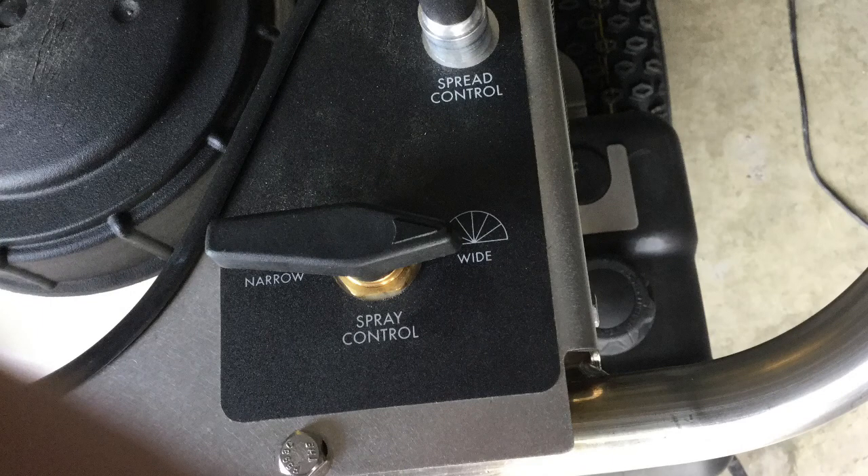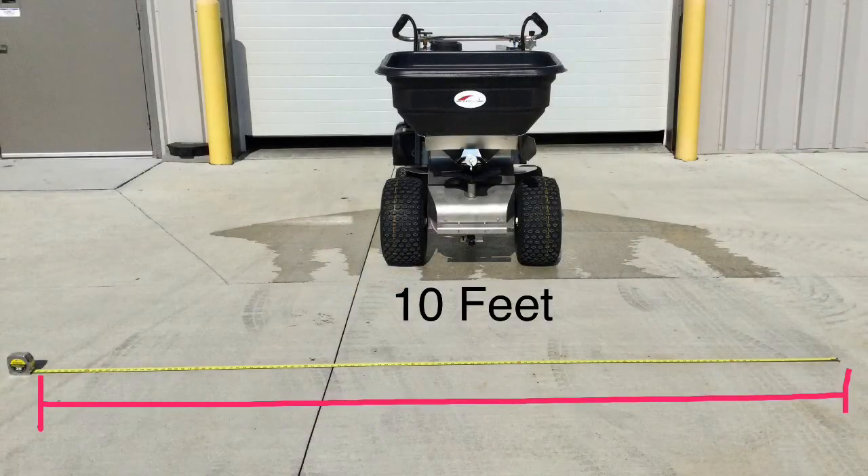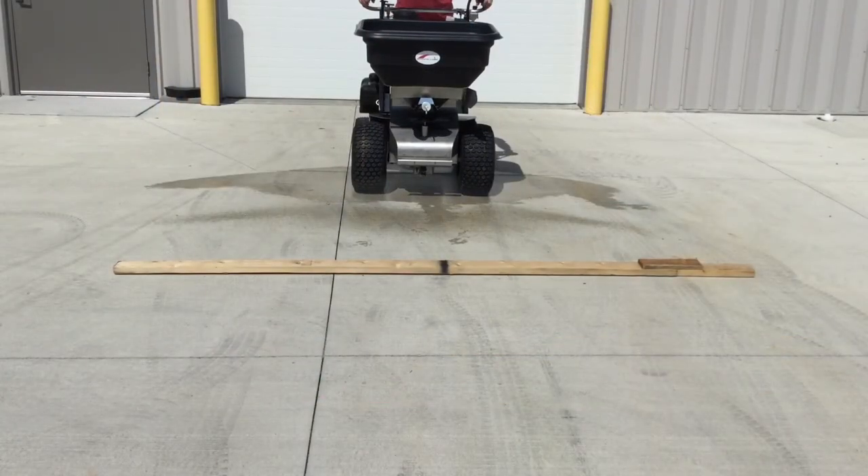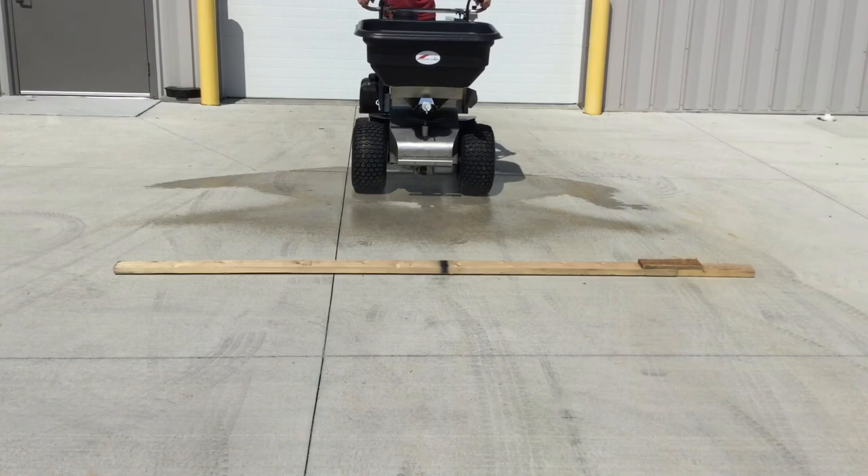Let's start with the wide pattern that uses the blue flood jet tip. Since you will likely need to move the machine to pattern the spray system on the concrete, you will want a way to measure the pattern and to be able to move it as well. Two ways to do that would be to either use a tape measure set to 10 feet or use a 10-foot board marked at 5 feet to center it. A good pattern should cover 10 feet across, be straight, and project out about 3 feet at the farthest point.